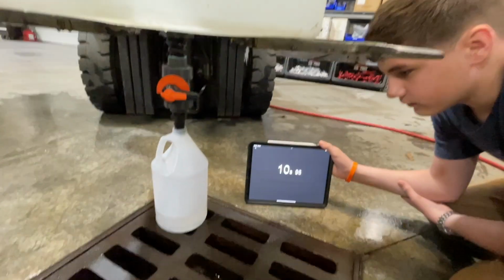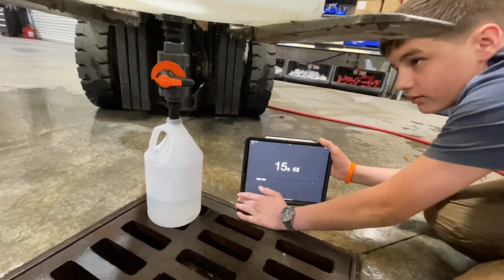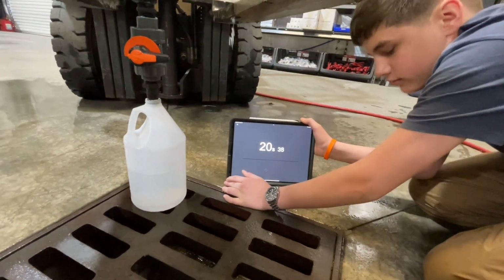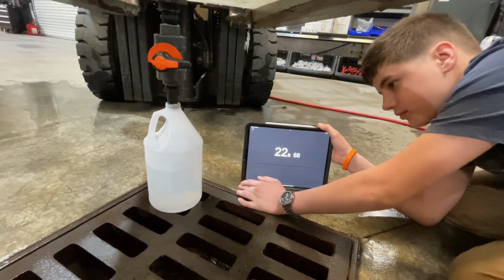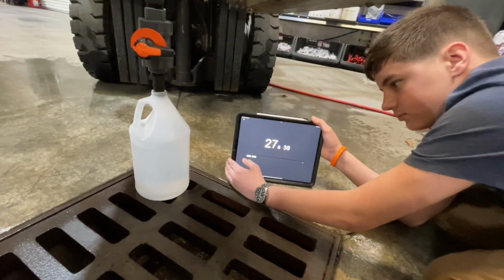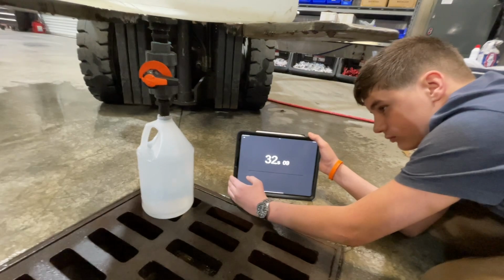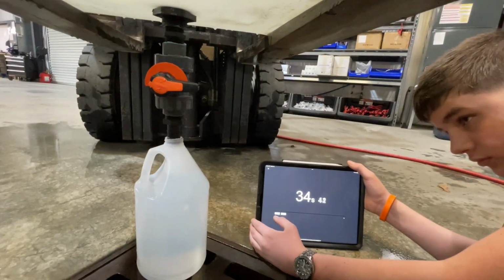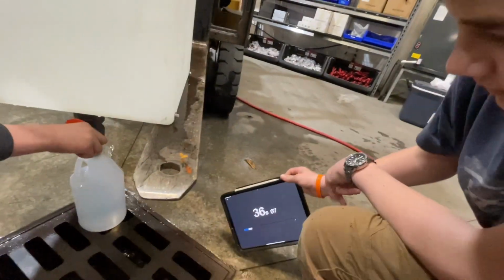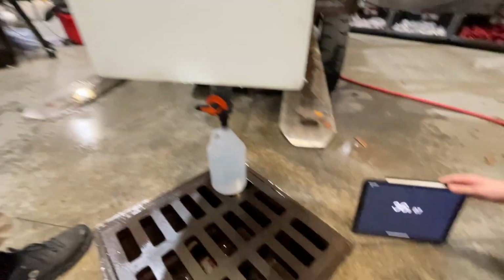These are really stiff, so kind of an awkward angle to turn it. But as you can see, we're only at 18 seconds. We'll take a second off, so we're at 1/2 a jug there. Much faster. So just going to a 1-inch valve body equals a lot of flow. Now the valves are more expensive, but that's one of the cool things about the Batch Buster, it is a 1-inch. And stop. 36 seconds. We'll cut a second or so off for Micah's weakness. 35 seconds. Y'all good with that?